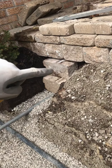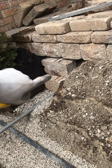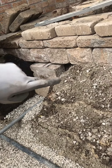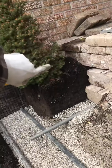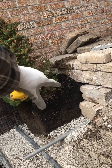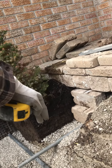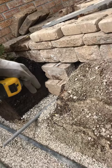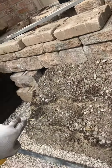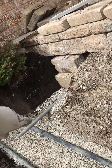I leveled the area there for those two pieces to fit in perfectly, and once they were fit in, I sloped it towards the inside away from the flower bed. You want to minimize water going into the flower bed because that'll cause expansion from frost and heaving against your walls and steps — you don't want that in the wintertime. So I sloped it all towards the middle, then put in the fence rail and made sure it sloped the right way.